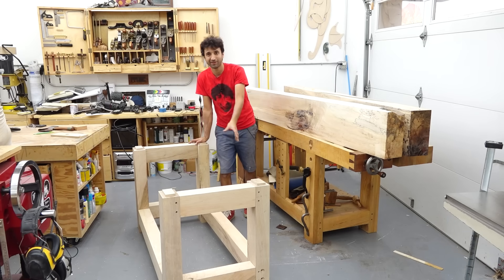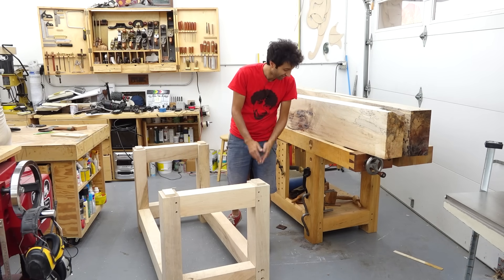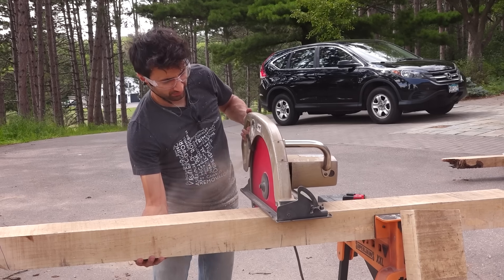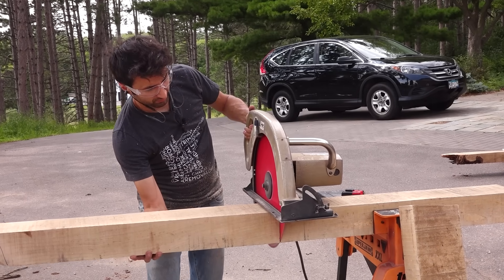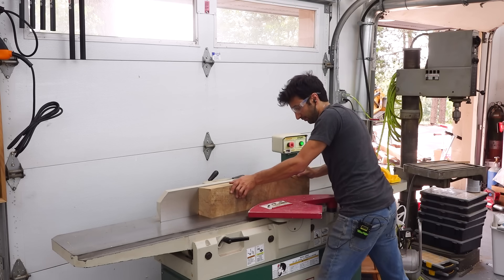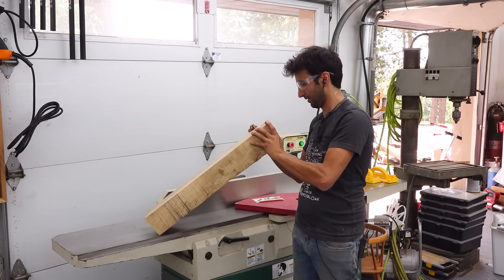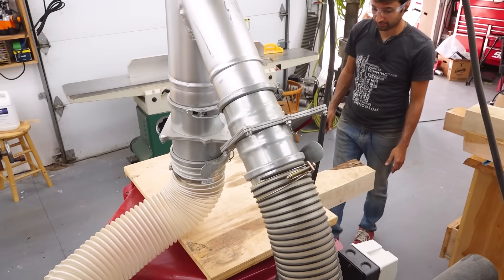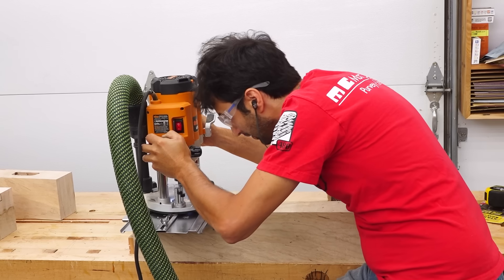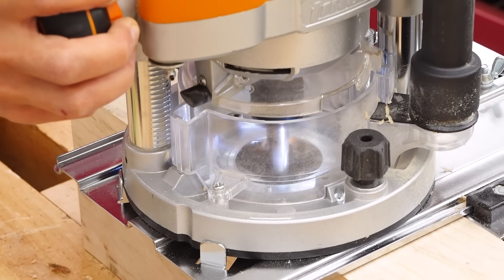So here is the base, all dry assembled. It's made out of single pieces as well — it came out of four-by-sixes, unlike mine where I have two pieces of eight-quarter glued together. Making the base was kind of nice because it was a bit of actual joinery and woodworking. One of the things I kind of forgot about building these benches is that with these pieces being so big and those mortise-and-tenons being so large, everything has to be dead-on perfectly square off the saw, because any out-of-squareness definitely tends to exaggerate itself and will chase you through the whole build.